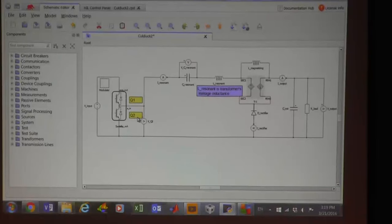This diode says it will never conduct negative current, and this current is always positive. When this current splits in two directions, the output inductor current — the output load current — cannot go negative. I'm giving you the broad picture first, then the detail. It's like looking at the forest first — that's why lectures are more valuable than reading a book, because I can point out first-order then second-order effects.